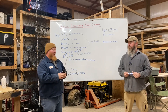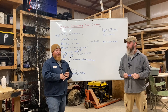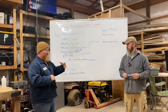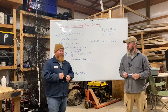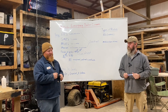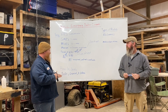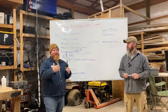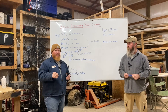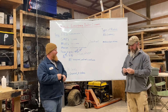If anybody asks me what license to get, I'd say General at the least, because you really need that regional and nationwide capability, especially for emergency comms. As far as radio-to-radio communication — what we call simplex — you can do a lot of that locally with a Tech license, but on HF it's mainly simplex. You're not talking through a repeater like on two-meter. And in a grid-down situation, simplex radio-to-radio communication is really where it's at.